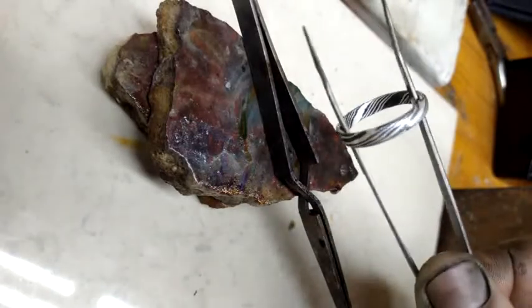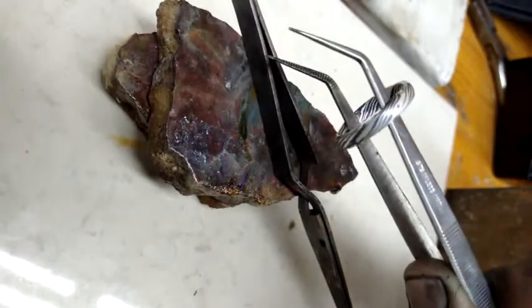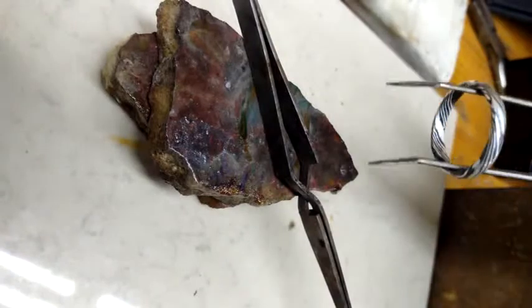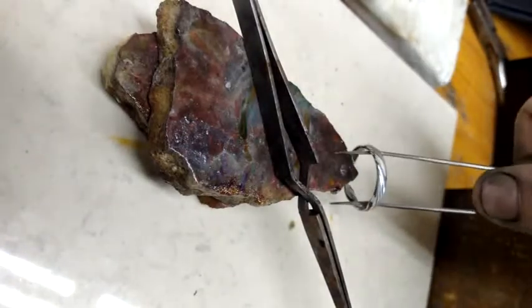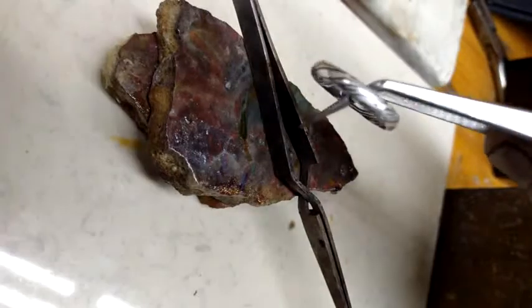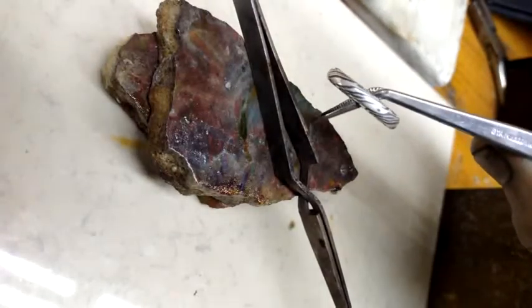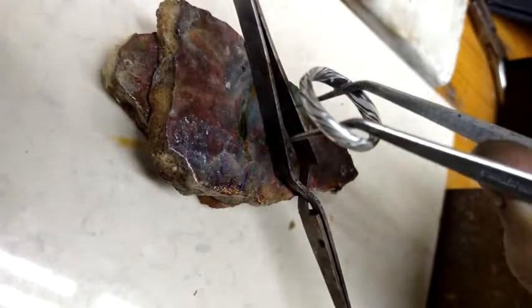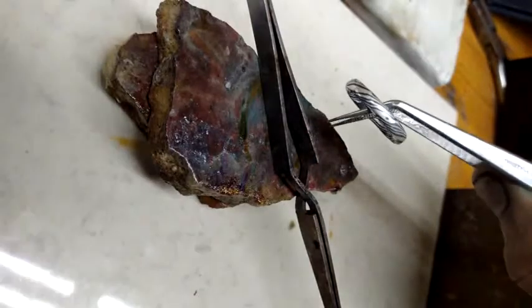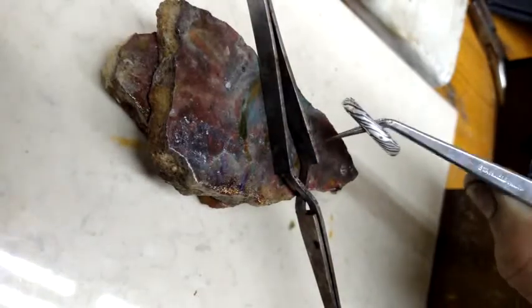That alloy oxidizes wonderfully. Hit it with a little bit of heat and it turns jet black. Fine silver, on the other hand, will not oxidize under any circumstances. So what you get is 2 different metals that are made from the same base metal, very, very similar in nature, so they're easy to bond. A little too easily, actually. If you're not careful, the whole thing melts. But they're easy to work together. Once you get them bonded, it's a dream. And upon a little bit of heat, one gets clean, one gets jet black.